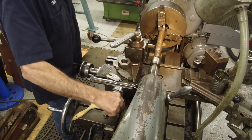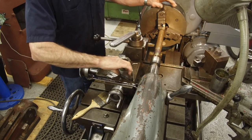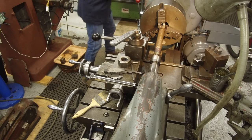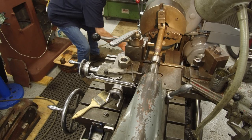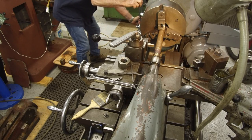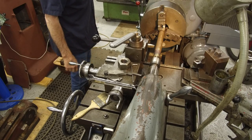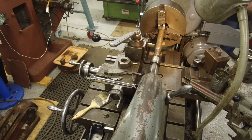Now we can adjust in and out. Now we're going to line up with our pitch. Here again, number 4 pitch. So we've got to put our feed on number 4, and we'll be on C and A. I keep going like that because I keep forgetting that I actually have to have a phase converter rotating to engage power. So we'll do that.